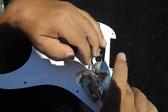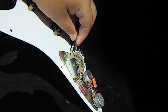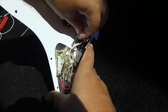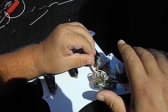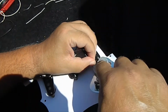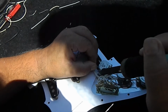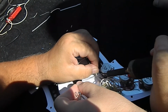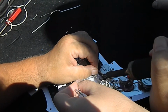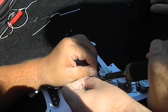Anyways, I'm going to have my son once again come on in and hold the solder, and let me turn this so the camera person can see what I'm doing. Could you see good there? Okay, Casey, let me heat this up real quick, that side of the pot. Now come on in, and we're going to hit the solder just like that. Go ahead, Casey, we're not melting yet. Keep going. It's a ground, you want to get this good. Okay.